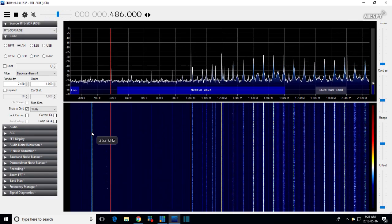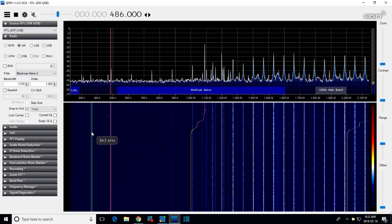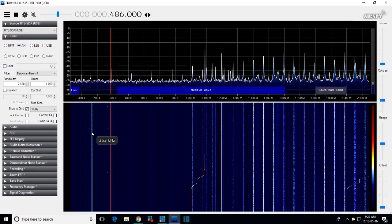And that represents the sweep signal passing the tuned point of the radio, which has been left at, oh, we're way down at the bottom here. Let me move it up. Okay, so we're under the civil defense symbol at 640. So you see the IF produces the same pop, but it's not actually the same pop. It's actually as the sweep sweeps by the new tuned point, which is now 640, I forgot.